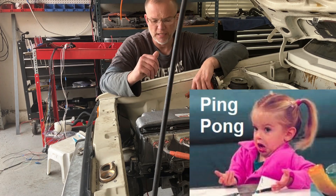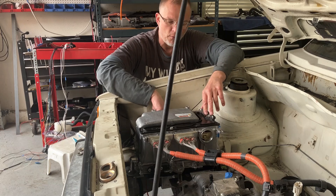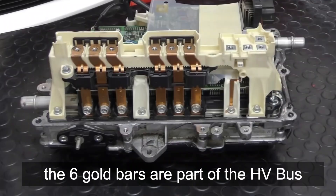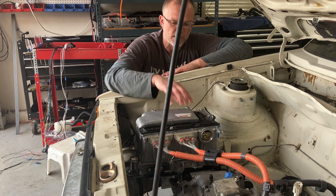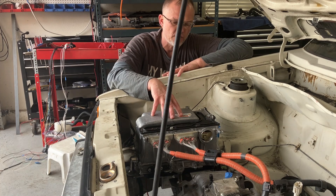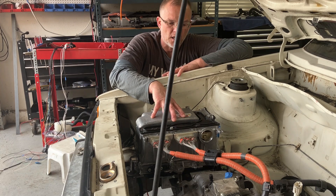Something to do with table tennis. So I'm going to bring you around and show you where we will plug into the bus bar system, which is essentially just a bunch of metal bars bypassing certain components and tapping directly into the high voltage bus on this inverter, allowing us to pump in more voltage into this box.